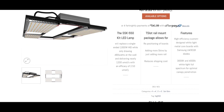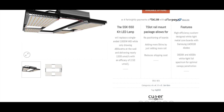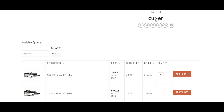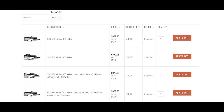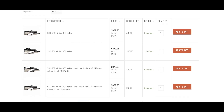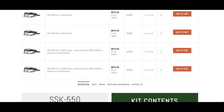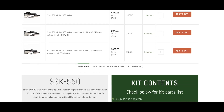We have it currently in four versions — two colors, 4K and 3K — and the same color versions but with the 2100mA driver. In the A version you can pop the lid, press the black button on top, access a little pot, and overclock the current drive to get the full 550 watts if you're inclined to do so.